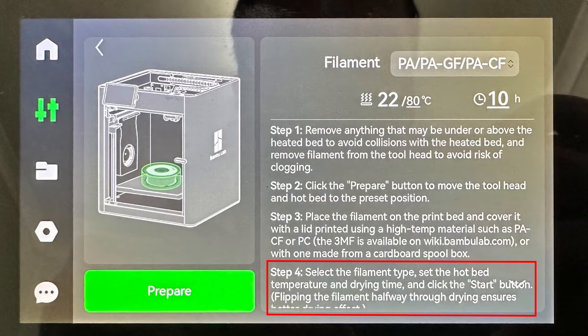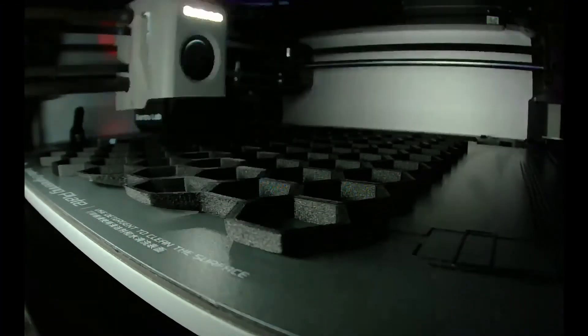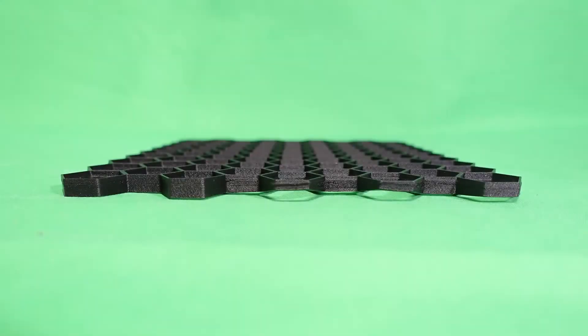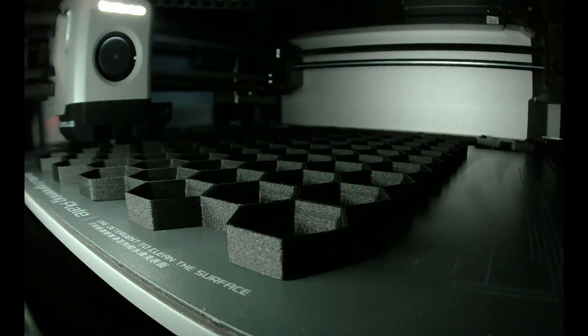After another four hours passed, the PAHTCF was ready to print. I was really nervous for the first print as I've never printed with this material before. However, after I saw the first few layers, my nerves went away. The first print came out well, but not perfect. A few of the hexagons didn't stick to the bed properly, so before I printed the next two panels I put some more glue down on that section of the build plate, and as you can see from the time lapses, the results improved.